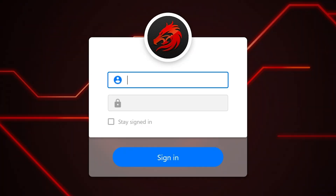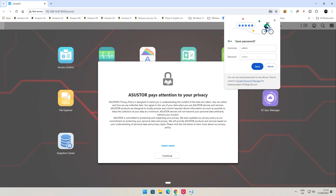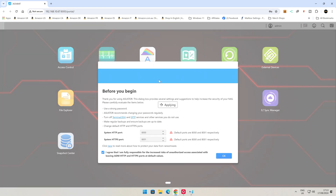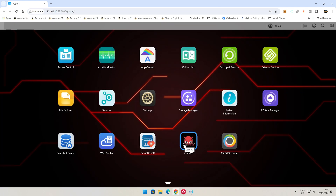And now it's great because we've got access to the actual screen. The time and date is still okay because our data is still intact. So what we can do now is use the admin account — admin and admin — hit enter. And there we go. It's asking about changing your password because it found a data breach, which is pretty obvious. We'll cancel that. Now we're essentially logged in, and you can change things like your HTTP and HTTPS ports, which I suggest you do.